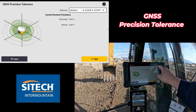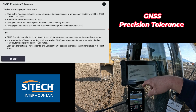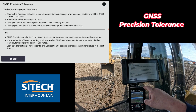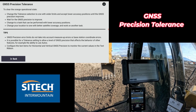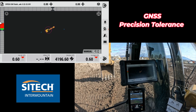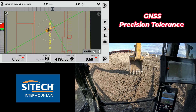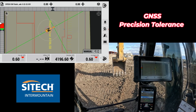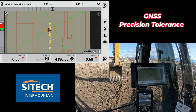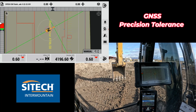The other thing you can do is each one of these menus has a little eye in the corner right there. This is going to give you a little information on kind of what I was just saying about your GNSS precision error limits. But just be aware of what that is and don't be misunderstood that my machine is only cutting medium — no, it's still cutting what it's cutting no matter what. But knowing your menus and knowing all this stuff is really, really key.